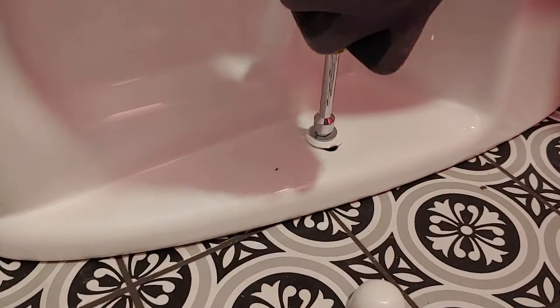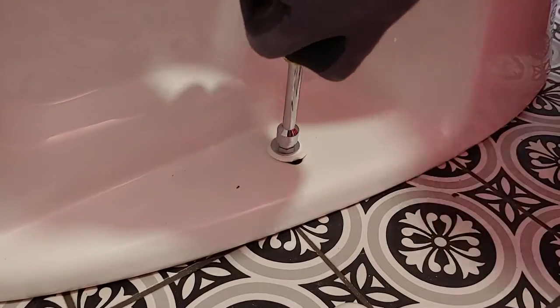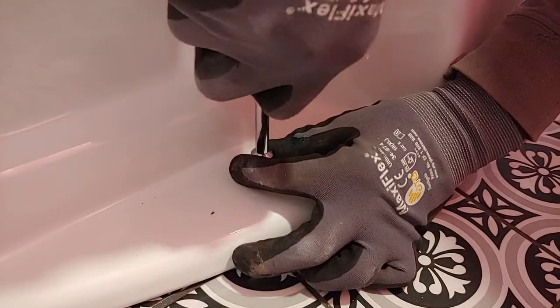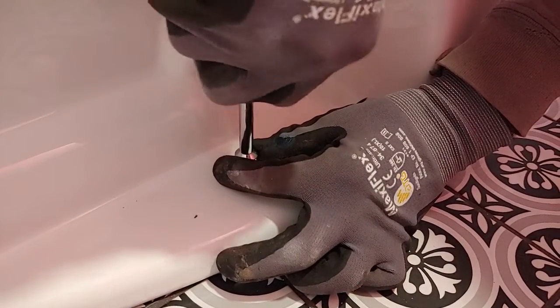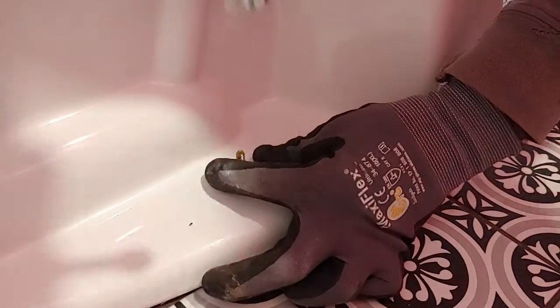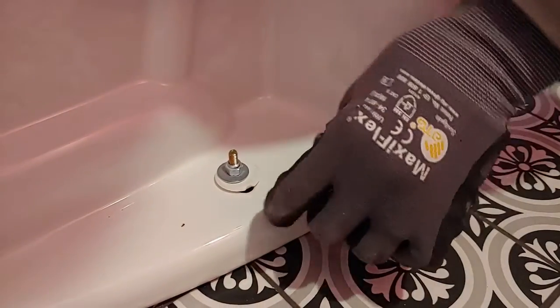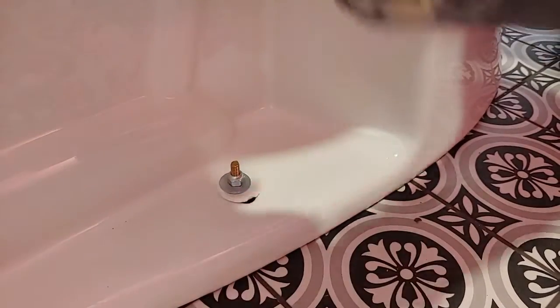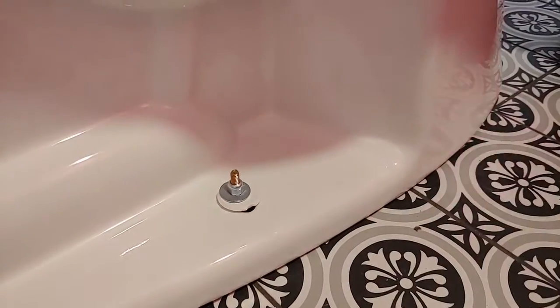I've got a nut driver so we can kind of hand tighten it. You can kind of see, you want to have that little plastic guy cover the elongated hole as much as you can. Now you just don't want to torque it down because this is porcelain and you can crack it. It'll just crack right here. It'll go right up the tank. You'll ruin it.